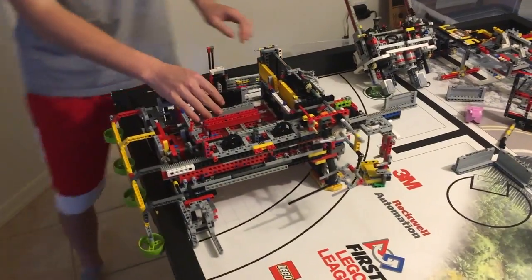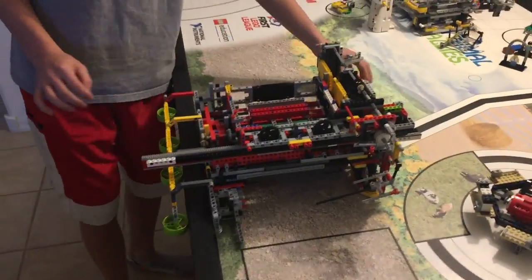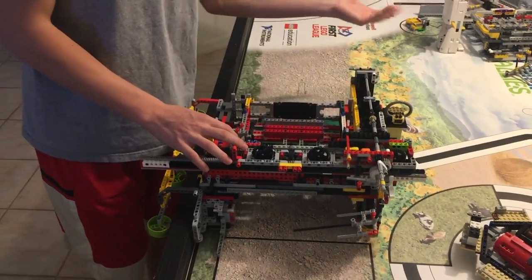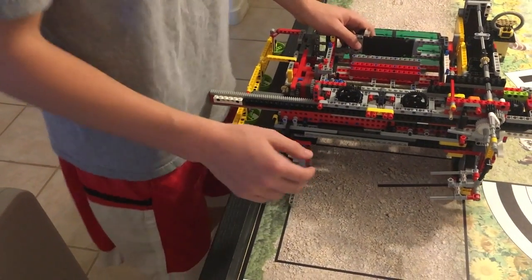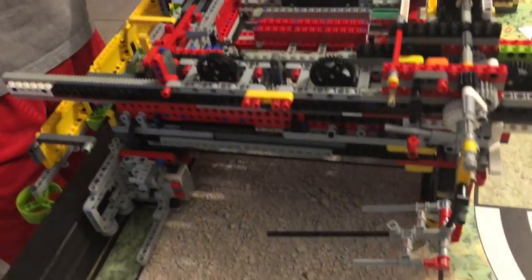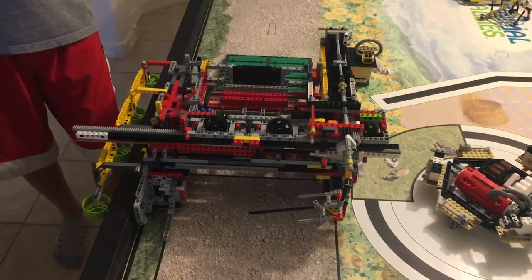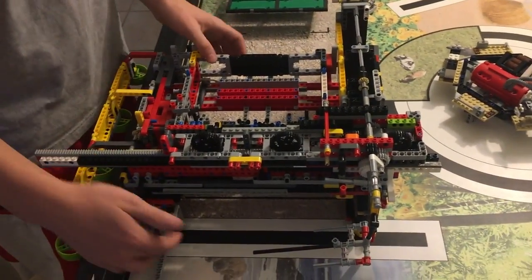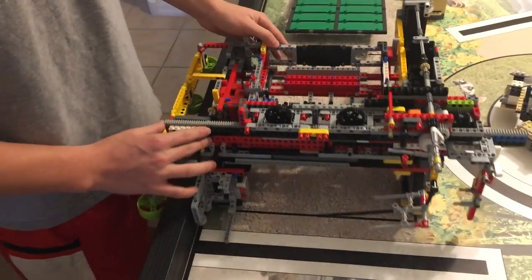In mission two, we start out and push the food into the circle. Then we go down and drop the bee onto the hive — the honey comes out passively. We have a color sensor down here, which allows us to be more precise, since the gear ratio in our robot is sometimes unusual and it's very hard to measure the right rotations. So while we're down here, we check the black line many times to know exactly where we are.